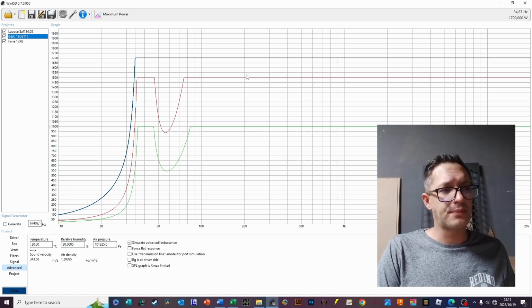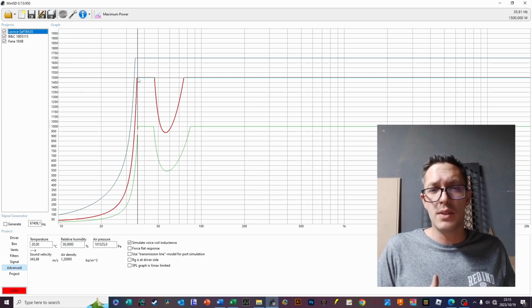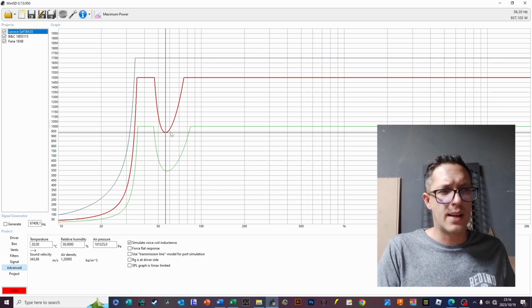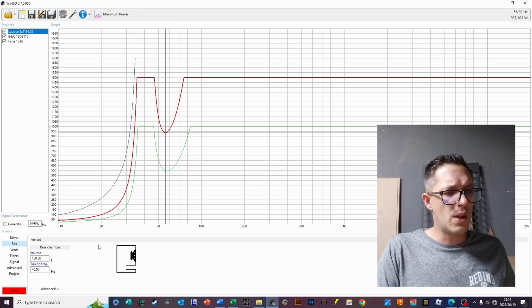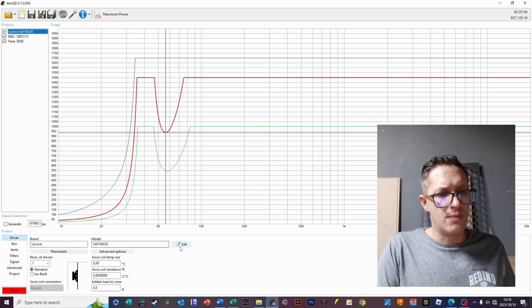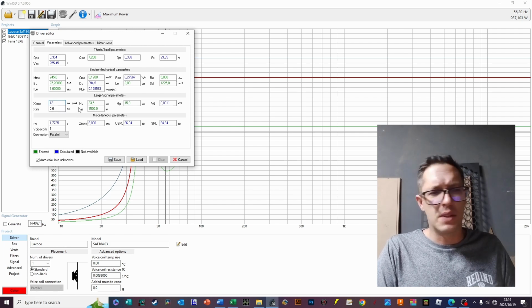If we go and have a look at our Loudness speaker, without using the full cone displacement, we kind of run into a problem. Okay, and this is really important to start understanding spec sheets, guys. Again, our driver, it's either 12 or 13 millimeters, and I want to bump this up to just show you how important cone displacement actually is. So I'm going to go to driver, edit, parameters, and Loudness, please don't hate on me, but I know it's 12 or 13 millimeters, somewhere around there.